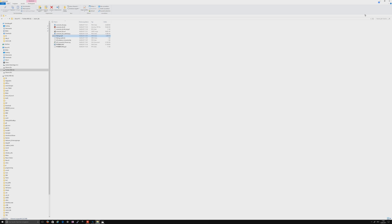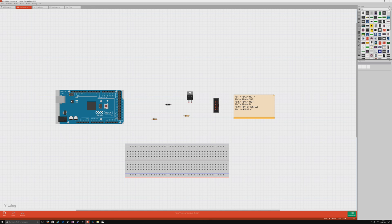To connect this to an Arduino, you need an Arduino Mega — or at least one Arduino with multiple UARTs. One UART is used to communicate over the USB-to-UART converter to the PC, and the other is for reading the sensor. Here is the connector of the Xiaomi LDS sensor, with the pin connector marked.